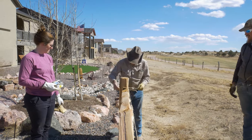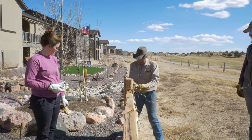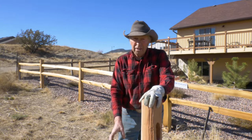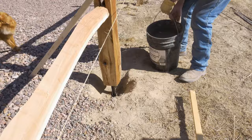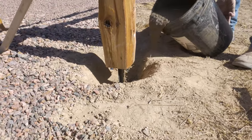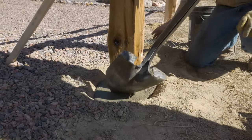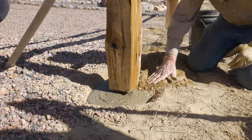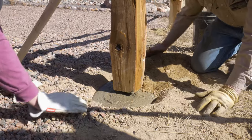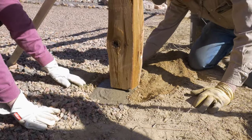You'll come along bracing and filling the bases with concrete — about 10 inches in diameter. Our post system is designed with the steel going in the ground, then you'll have about a 10-inch concrete cap at the top of that steel post. The wood post sits down right into the concrete, and it has a couple of clips that lock into the concrete as it dries. You're digging a hole about 10 inches deep and 10 inches in diameter — roughly one gallon of concrete per hole. If it's sandy it may take more, if rocky a bit less, but you just want that reinforcement at the top.